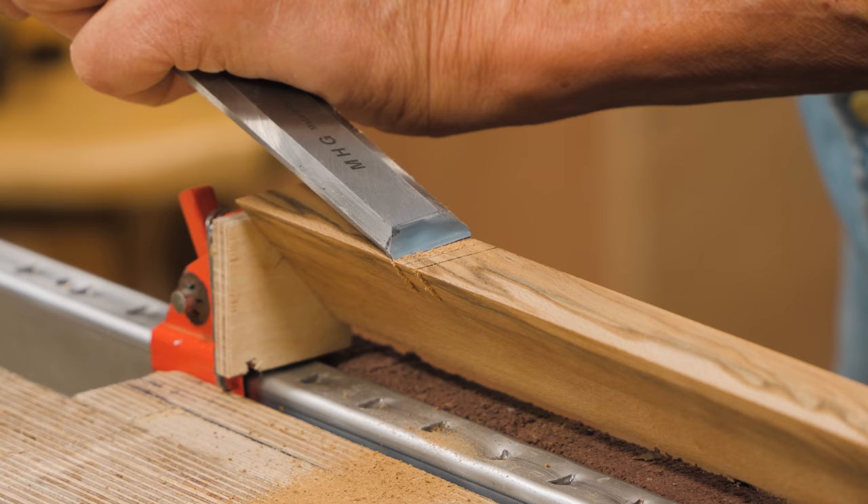I love this. So this is going to go on here. I've got my center line down in the bottom there. I've got a couple of things to do to this piece of wood. I want to glue this on so I can leave it to dry for an hour. I want this centered on here — equidistant from each end, which will be two inches for me. And I can see my center line right down in the middle of the recess.